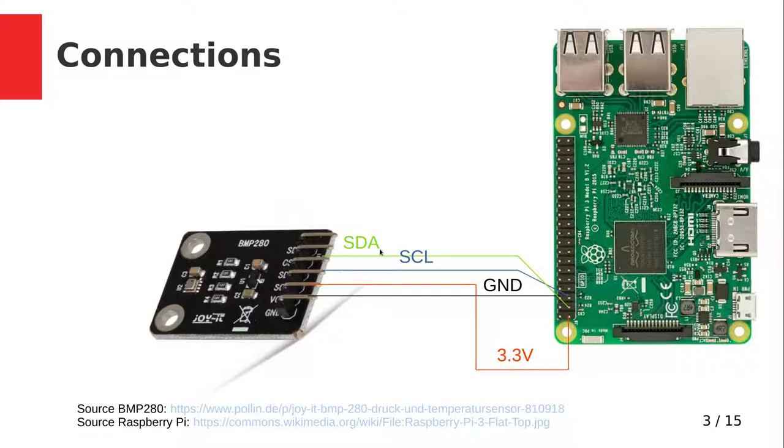The next two pins are serial clock and serial data for the I2C interface. This chip also supports the SPI interface, which adds two more pins: chip select and serial data output. In SPI mode, that fourth pin would be serial data input. If you don't connect the chip select pin, the sensor knows you want to access it over I2C. And if you use such a board, you don't need any pull-up resistors because they are already embedded on the board.